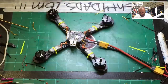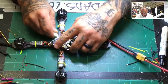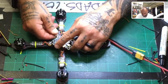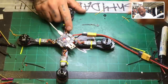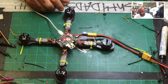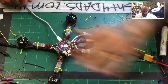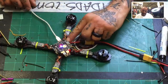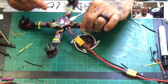The VTX comes on when the USB, I mean, it looks like it's on. See, when I plug in the USB, it's 5 volt, and it's not giving it. But oops, there is a switch right here. So what will happen is you see how when I apply LiPo power, if that number disappears, it means there's no VTX, right? Boom. Okay, it's off, right? It only comes on if the LiPo's off. And so there's that switch here on the side, this little white switch right here, and that's the switch that you flip to give yourself VTX.